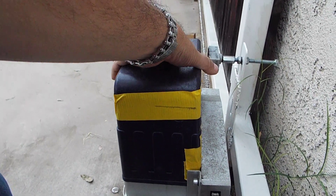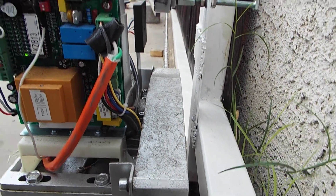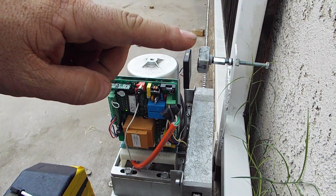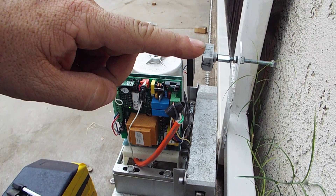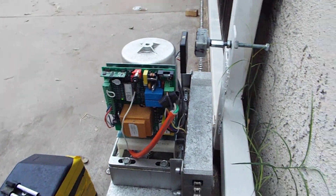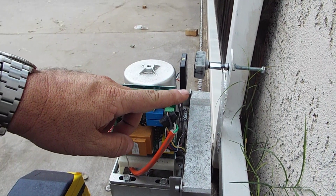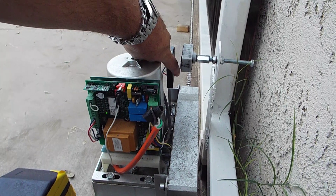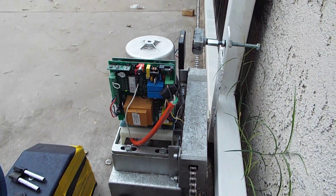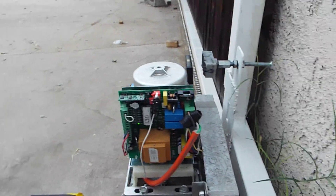The big question was where my sensor would rest relative to the magnetic switch. As you can see, the sensor actually rides pretty high on the magnetic switch — same for the other side. I also made the mistake of reversing the sensors: the top sensor is for closed, the bottom sensor is for open. I spent two weeks swapping them and it wouldn't work. Make sure you know which sensor is for which position. For the open sensor, it barely covers the bottom of the magnetic switch, and you want to leave the middle open — if you go through the middle it interacts with both sensors and confuses the operator.